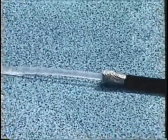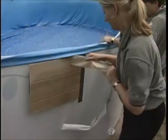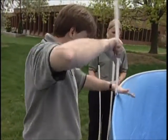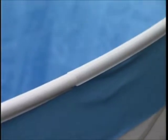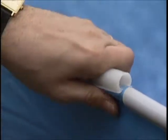When most of the wrinkles are gone and the liner is in the correct position, begin filling the pool with enough water to cover the bottom only to a depth of about 1 foot or 30 centimeters. Shut off the vacuum, remove the hose, and unseal the skimmer and skimmer return. Starting one piece at a time, remove the coping, smooth out the liner, and reinstall the coping along its entire length. Continue working around the pool, smoothing out the wrinkles, adjusting the liner, and installing the coping.